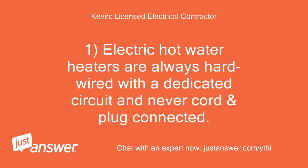Electric hot water heaters are always hardwired with a dedicated circuit and never cord and plug connected.